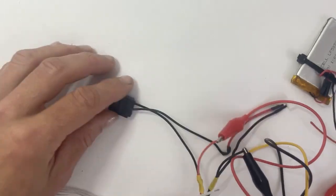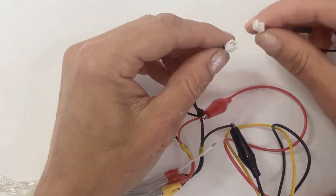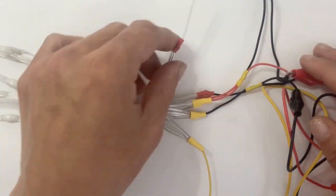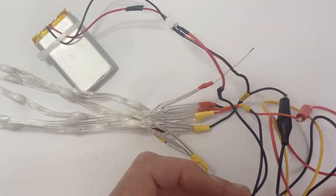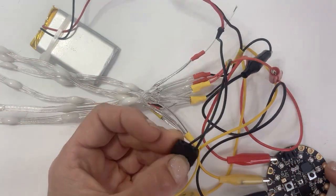Finally we're ready to wire up the cutie pie. My yellow wire is going to A0 and my white data wire goes to A1. The red wire goes to five volts and the black wire goes to ground. Once everything's wired up, turn it on — your lights should come on in yellow. If they don't, check the Adafruit learning system guide for some troubleshooting tips.